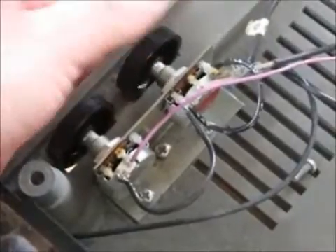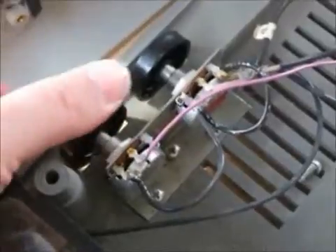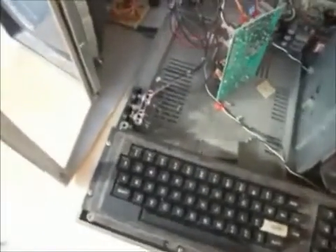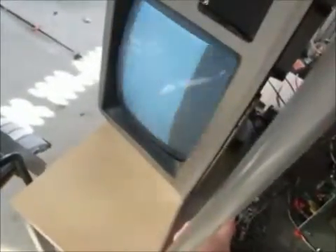It's been about five minutes since I've sprayed some isopropyl alcohol into the switches on this manky old Model 3. That one is now turning smoothly; the other one is a little more difficult to turn but not too bad. Moment of truth — we'll fire up the Model 3. That's the big white raster we saw before, and as I turn that one the raster goes away. I'll turn the contrast up and there we are — we can see it working.